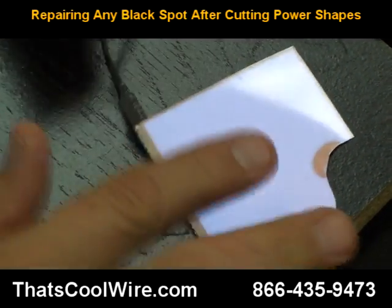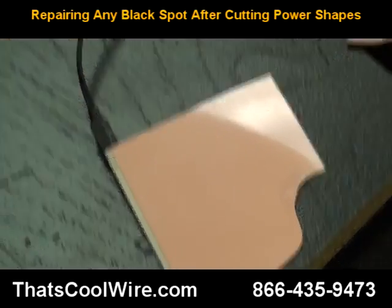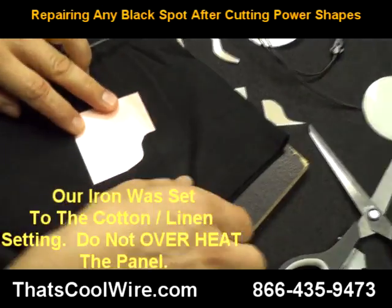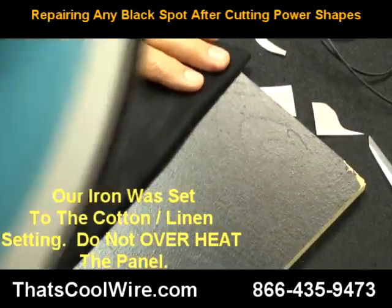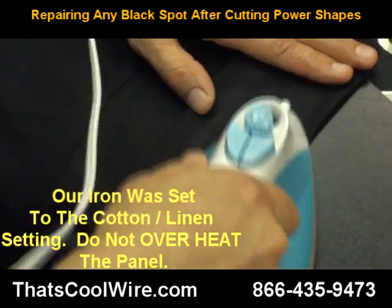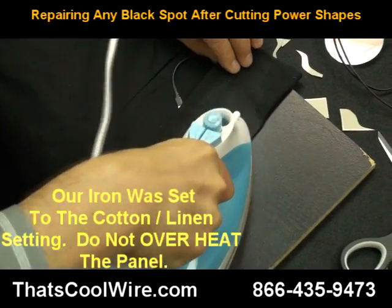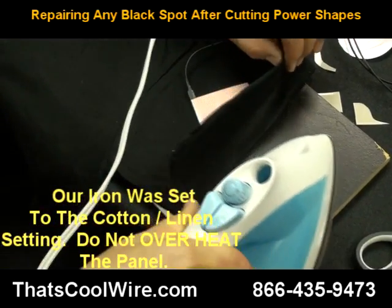We still have the spots from the curve, so we're going to work on the one with the bigger spot. We're going to turn the inverter off. The tool we're going to use — believe it or not — is just what every household should have: a regular iron. There's the spot. I'm just going to fold the shirt over, grab our iron — it is on the linen/cotton setting. You only really want to apply the heat to that one area, not the whole panel. I'm pushing down and applying some pressure, lifting up the shirt every once in a while so I can tell if that spot is going away.